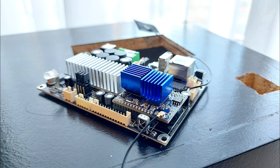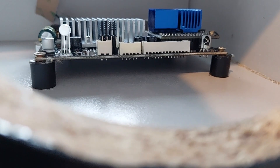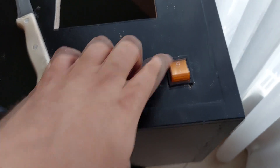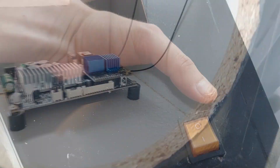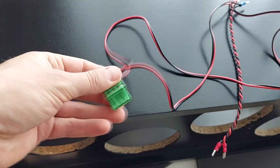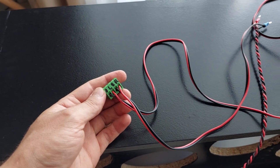For extra safety we put two heatsinks on the LAN card module because the little chips were kind of warm after the tests in the first video. Now we screw in the Aurelic amplifier board on spacers for better cooling and air circulation underneath. Then install the on and off switch. We'll insulate everything with hot glue to prevent air from getting through. Glue wireless and Wi-Fi antennas on the side panel to improve reception. Then prepare and connect the amplifier board speaker terminal wires that will connect all four speakers — they will be connected in parallel, two per channel.